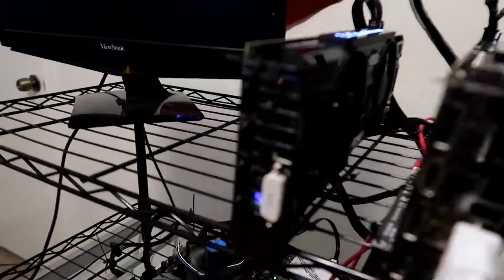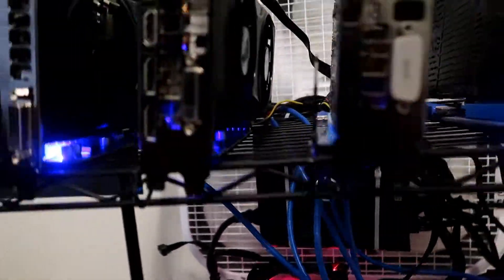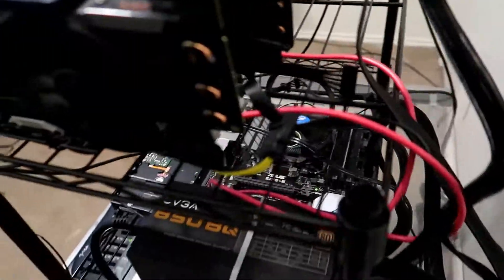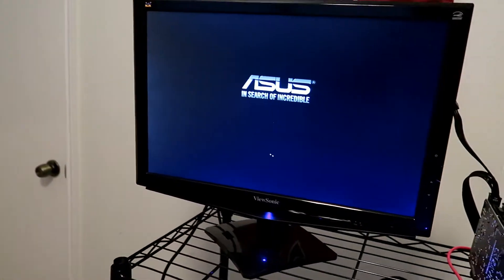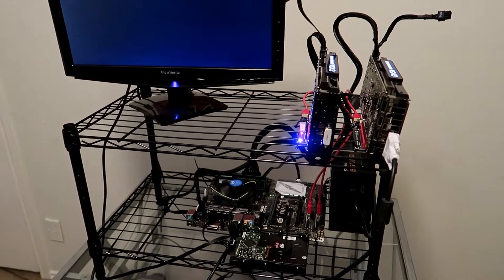It turned on right away. Those are the two LEDs on the Version 9, not available on Version 6. On my other rig I'm using Version 7s — the blue ones — with one blue LED, but they also have the adapter to SATA to 6-pin, which means more risk of fire and loss of power draw. With this one it takes a while to boot up because I just put a new card on. I'm going to put an overclock on this card and compare with the same overclock to see which one makes more on Zcash.